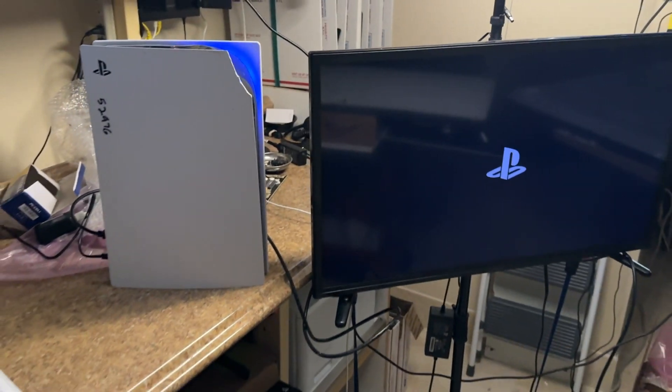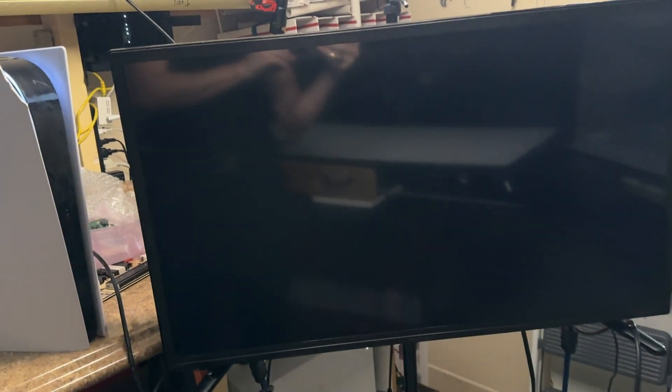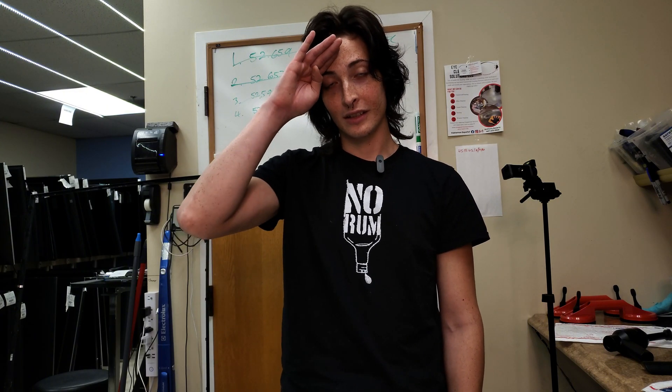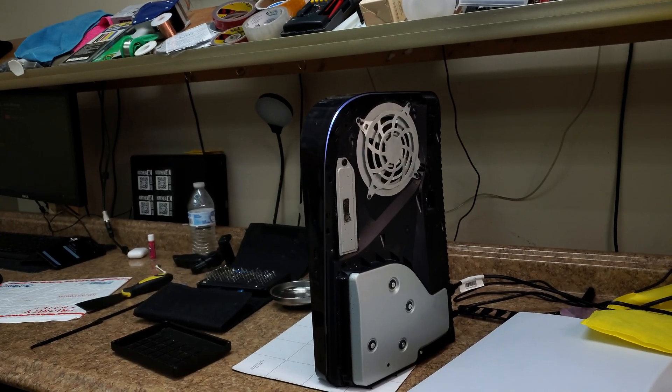That's how I do it, that's how I've been learning. There have been some failures — but that is actually my most successful HDMI port repair yet. Normally it might take me two or three hours just for the soldering if I mess up the trace lines. But there's progress: first I was ripping up trace lines I couldn't fix, then I could repair them after a few hours, and now I can fix it without messing up any trace lines. It's good to learn all that, because sometimes you get a device where the trace lines are already damaged. All practice is good practice, especially when you use the right tools. Thanks for watching. Now that is one good looking PS5.